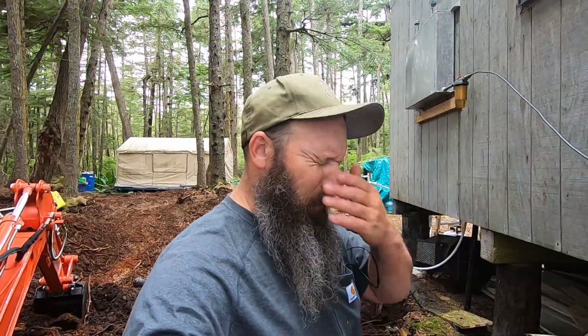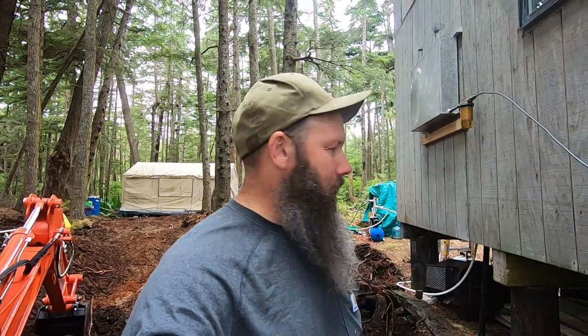Well, this is what I suspected because we never had good drainage in here. There was no real leach field. It's just the kitchen sink went down to a 3-inch pipe and was just buried right here. So part of putting in our water tanks is we're also going to bury some 3-inch pipe, and we'll go 30, 40 foot out that way, and we're going to dig up and try to do a proper leach field. So our kitchen waste will have somewhere to go. But yeah, this was definitely not acceptable.